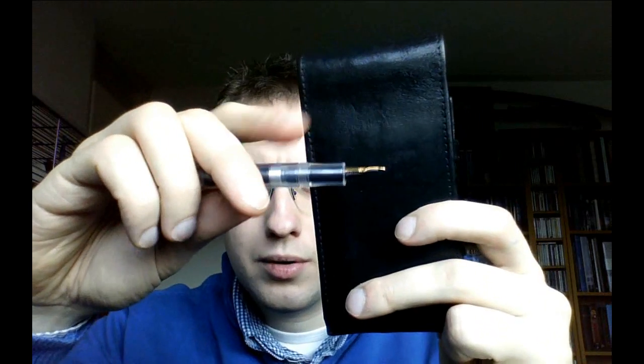The most important thing to note here is that the nib is made of a specific material. In this case, it is stainless steel, which is then plated with gold. That's not always done, but with this pen, as you can see, it is gold plated. Most important of all — you see that at the very end of the nib, it's a sort of ball-like thing. These ball-like things at the end of the tines are usually iridium, a very hard metal. Gold is too soft; if you scrape that across the paper it will wear down very quickly. So you have these iridium balls welded to the end of the tines — the two tines that constitute the nib.